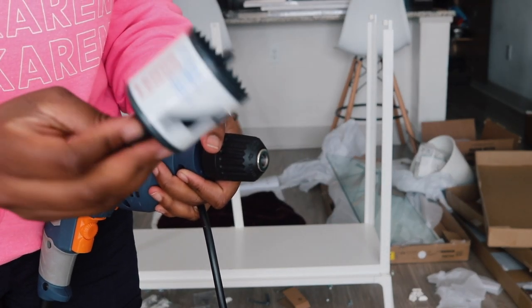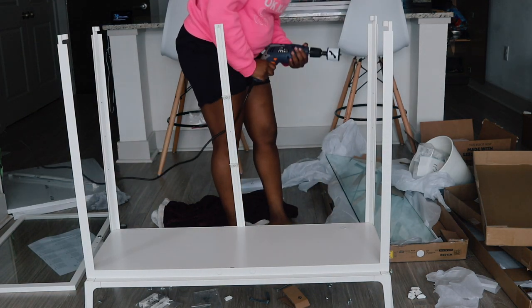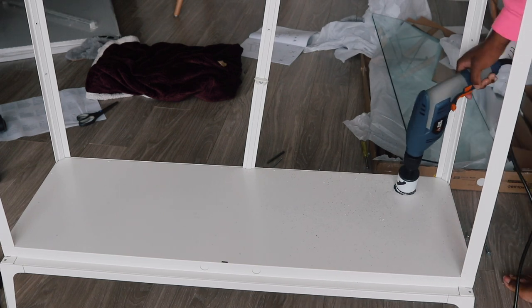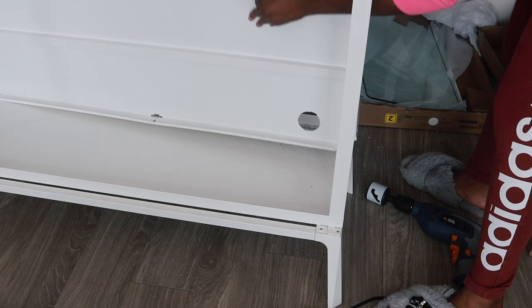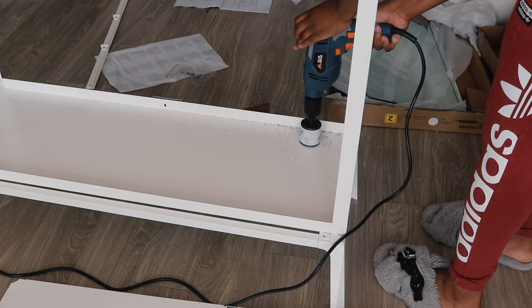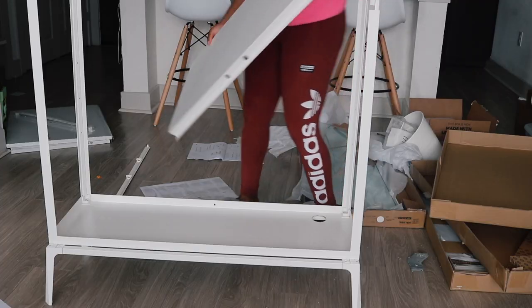To drill the hole, grab a bi-metal hole saw that is strong enough — like this Lenox 2-inch bit that I linked in my Amazon shop in the description box below. Once the drill hit the metal it started to kick back immediately because I went at an angle — like y'all trying to use the angle that there's an agenda to take down the black man to justify being okay with rape culture in our community. I initially drilled this all wrong and made it harder — like Phylicia Rashad and other black women elders who are dead wrong in sweeping rape culture under the rug in our community. You'll want to drill a small hole in the base first, then use the bi-metal bit to start drilling the bigger hole, pressing it firmly and going straight down with the drill. Use lower speeds first. Clean the bit and if you have oil, use that to make it easier. As the hole starts to form, kick up the speeds until the hole has gone through.